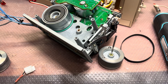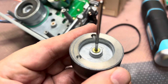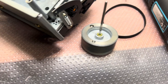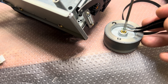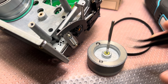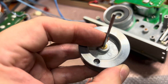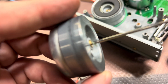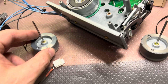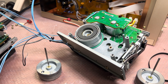One more thing — there was quite a hot discussion on the previous video. You may see the spacer here — it's transparent, okay, so don't ask me about that anymore. On the 555 series it's more of a white color. You cannot see it if you don't know what to look for. Trying to replace the supply-side capstan would not help, so we'll replace the take-up side and see.